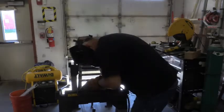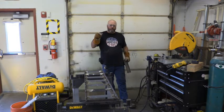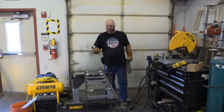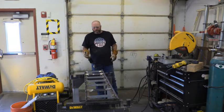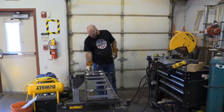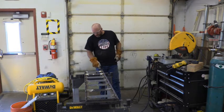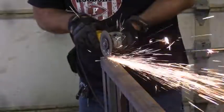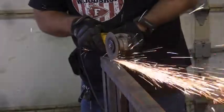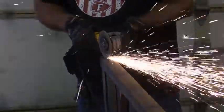We're going to weld this one down. The whole point of this approach is to make it so you don't have to get up that inch and a half, especially with something like a lawnmower, golf cart, or two-wheeled cart — things that don't have a lot of initial torque to make that climb. So we're going to do it the more traditional way: take some flat steel, three-sixteenths or quarter-inch, two-inch wide plate, weld it across, then take and cut a six-inch by one-and-a-half-inch angle to give it that approach with our angle grinder. My approach when using an angle grinder to cut is to make a light path along the line and slowly get deeper and deeper rather than cut the full depth following the line — you'll have better success in my opinion.